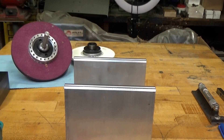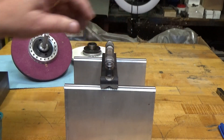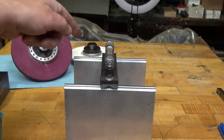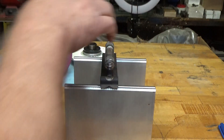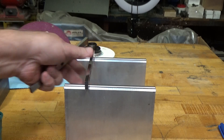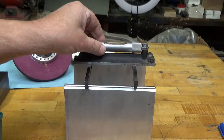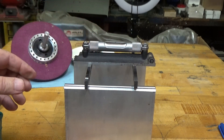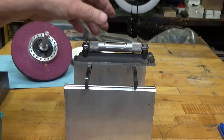This is the balancing jig that I made — there's a video on that. The first thing I did was level it up. I have my precision level and it is leveled up front to back, and then I put a couple of precision parallels across it and leveled it end to end.